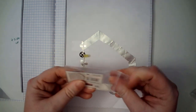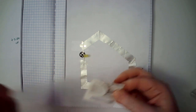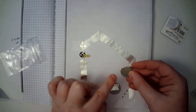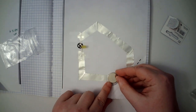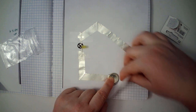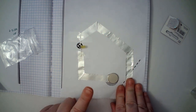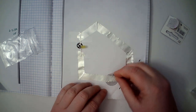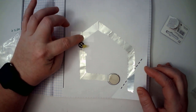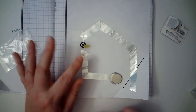Now test your circuit. Take your battery out of its house. If we did this correctly, the long side of the LED is along the long side, which goes to the plus side of the battery. Place it here — the negative side touches the negative side of the circuit. Flip this edge over so the foil touches that side of the battery and your LED should light up. If it doesn't work, first flip your battery over. If it still doesn't work, push down and make sure the metal leads are touching the foil with no glue, tape, or paper between them — that's what conducts the electricity.